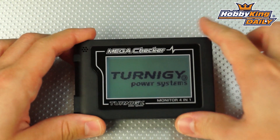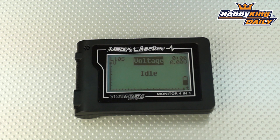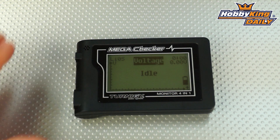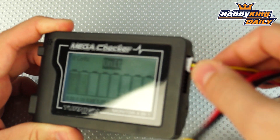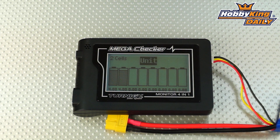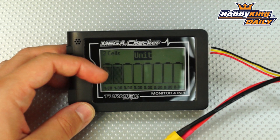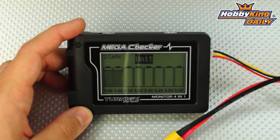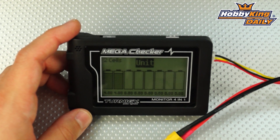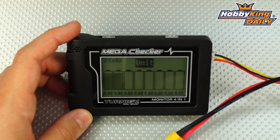So I'll show you here — we'll turn it on. The first thing to notice is the large backlit LCD display, which is quite large and very easy to read. And as I mentioned, 4-in-1, so it has multiple functions. The first and probably most useful is checking the voltage of your batteries. You can see here on the side there's a balance port where you connect your battery. Plug that in and it instantly shows you the voltage of the battery cells. You can see it's a two-cell battery connected here — it gives you a visual battery capacity display and the voltage per cell, which in this case is 4 volts per cell. This will handle up to 8S, so a wide range of cell checking for your different size battery packs.